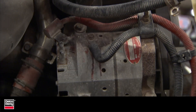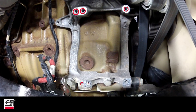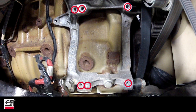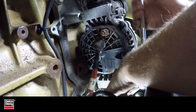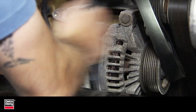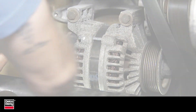The first consideration is the length of the pad. Heavy-duty diesel engines have six holes drilled and tapped into the block of the engine or alternator mounting bracket to accommodate both long mounting pads and short mounting pads. This is standard in on- and off-highway applications, so whether you are replacing a long pad mount style to a short pad mount style or vice versa, the alternators will interchange on the application.